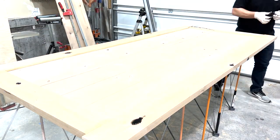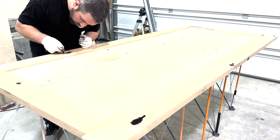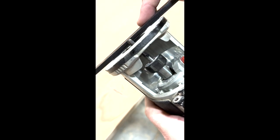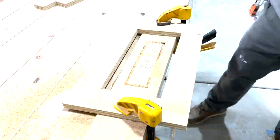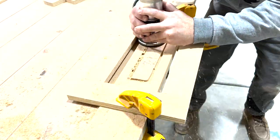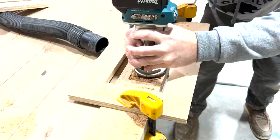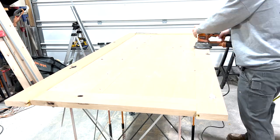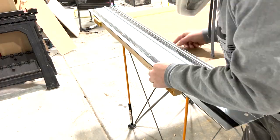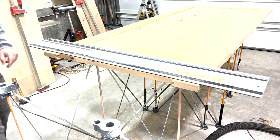After it's out of the clamps, since I'm using knotty alder, I'm going to fill all of those knots with a tinted epoxy — you can tint with stain or a dye. This next step is probably totally optional, but I think it makes the door look more professional: I'm going to route out a slot to insert the backside of the handle. A quick scrap wood jig makes it easy to route this out quickly, nice and straight, fitting that handle perfectly. Now it's our favorite part — sanding. Make sure you go through the grits and end with at least 180; I like 220. You may have noticed I didn't cut the stiles to final length before glue-up — that was on purpose, so I can trim the door to final length and make them exactly even with the rails.